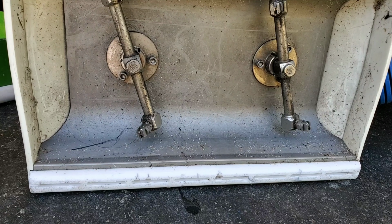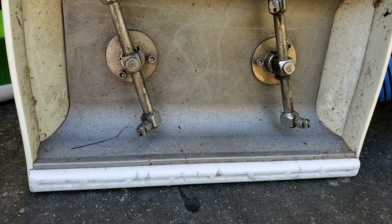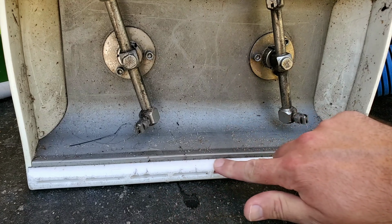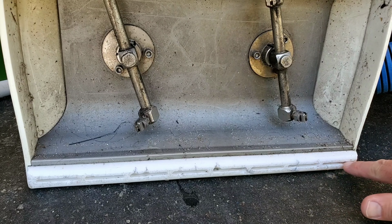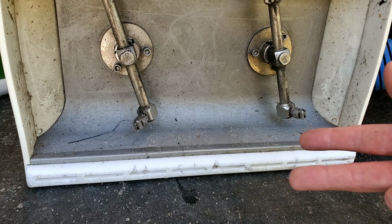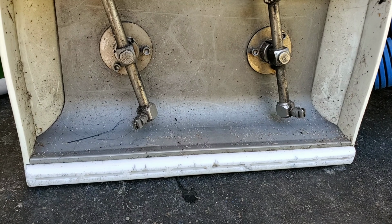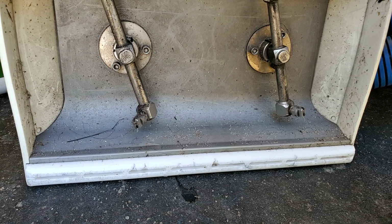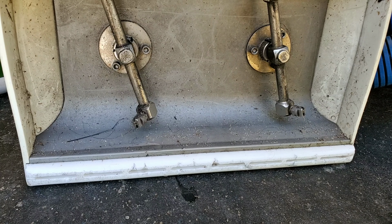Today we're gonna turn the glides over in this zipper one. It's a two-phase glide. So when it starts to wear, you can see all these chips in mine. It's worn down smooth. You're just gonna take that out and flip it, put it right back in, and you're good to go again.